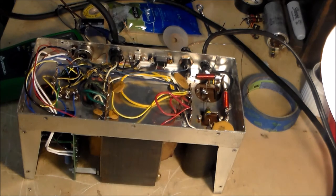Well, actually, I should take a step back. The instructions say, plug in the supply. If you hear crackling, snapping, or smell or see smoke, remove the power cord from the supply at once. Of course, I saw that before, and I'm very sorry that I did not record that spectacular moment for you, but the camcorder was being cantankerous and would not turn on. And so the orange wire should read at least 650 volts.